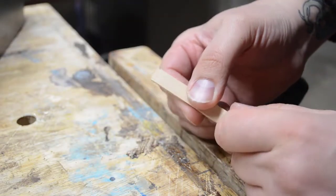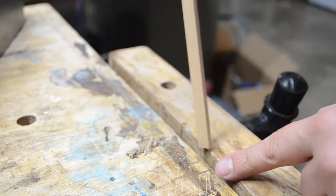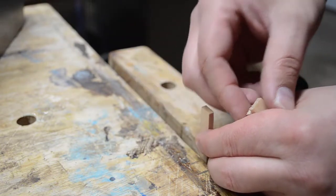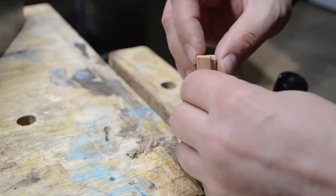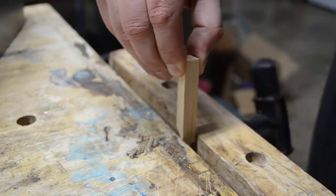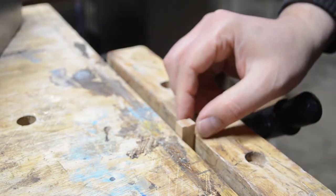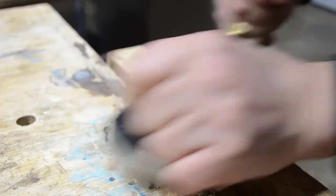The parts, now plain smooth, just need a cleanup of these fluffy saw-cut ends to put them at their final dimensions. I'll clean up the end grain by squaring it off with a hand plane. This is the final step in dimensioning, so it'd be an unfortunate time to have some end grain blow out. Using a jig called a shooting board would be a perfect tool for the job. Of course, that means I've already built one, which I haven't. So for now, to avoid edge breakout, two sacrificial pieces are placed to support the end fibers of the wood. Getting a piece this small square cut is tricky without a guide or large reference surface. It takes a few tries to set the piece right, so I can get a good perpendicular slice.